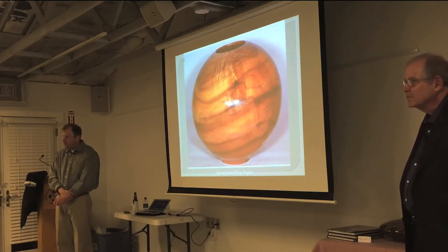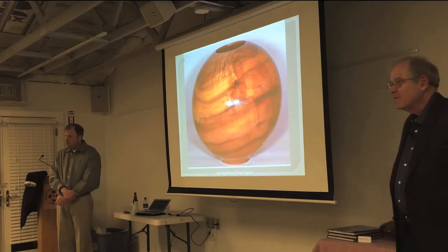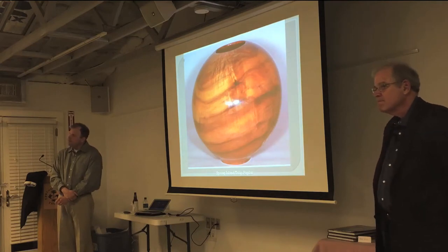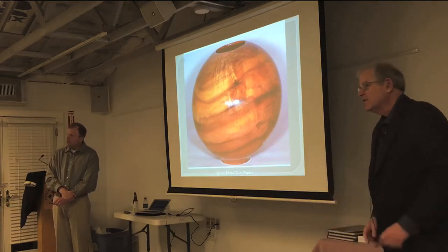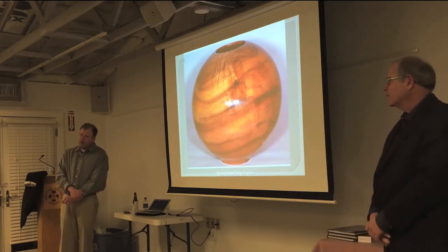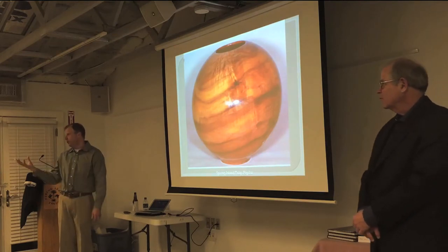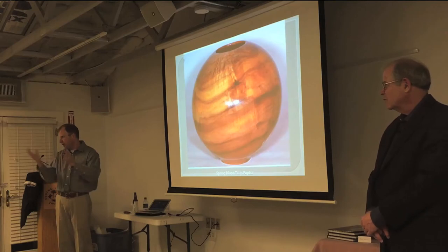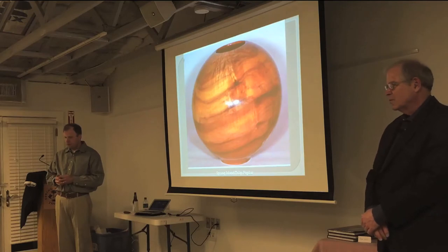When you're doing rough turning and you come across a gap, either caused by a fungus or some internal growth, what do you do with that? Some bowls that I've seen have open spaces in the lower part of it. Right. I mean, like a natural void? Right. Yeah, a void. It'll be incorporated if the wood is spectacular enough to be finished. We'll remove a section from another part of the tree and put it in there and then cut it flush. But it would have to be pretty exceptional to go to that trouble.